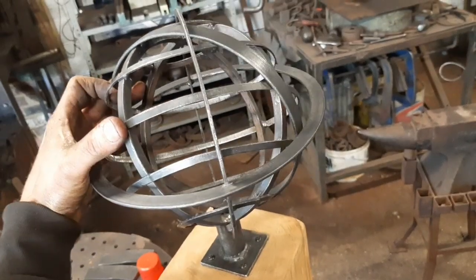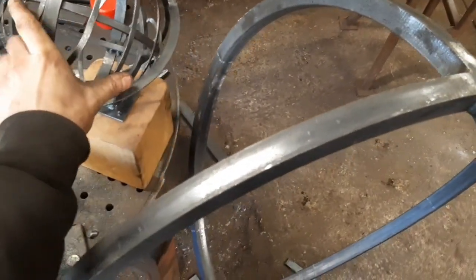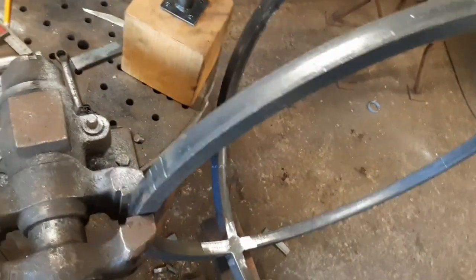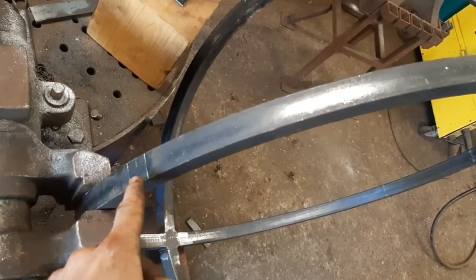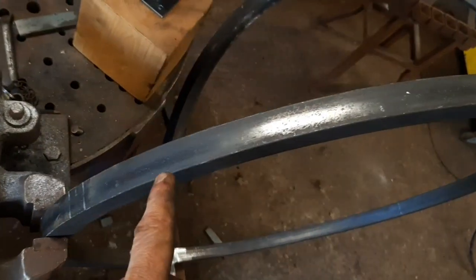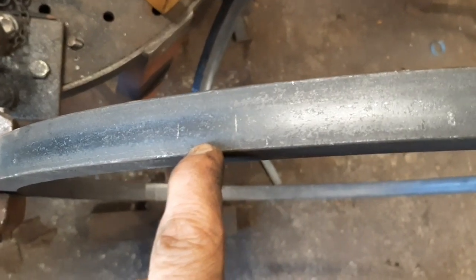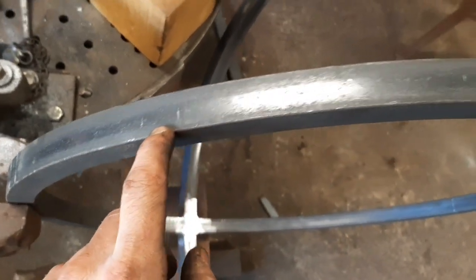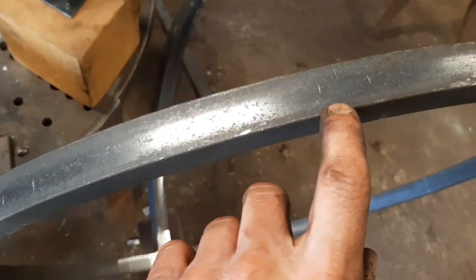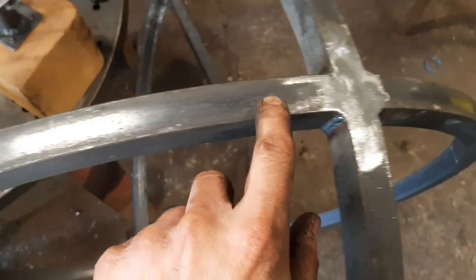Now this is a quarter scale, so that means 160 mil. So what I've just done is had a little trial run at positioning lines 160 mil. So here's, for example, the position of the equator ring, and then, let me just find, okay, there's a couple of lines in this reflective light which would denote the next band up, which would be a tropic, and then here's the next couple of lines up which would denote the pole, and then we reach the top.